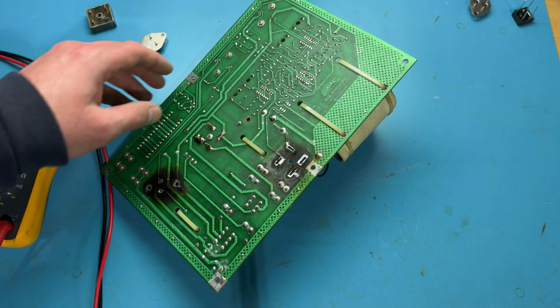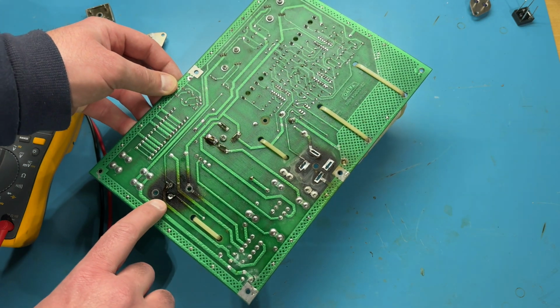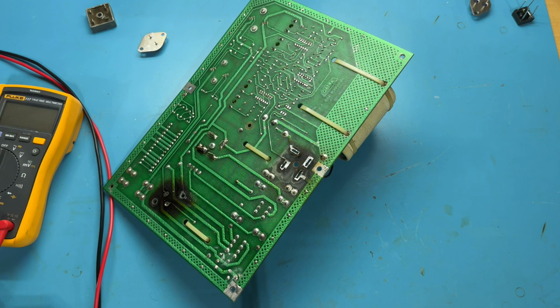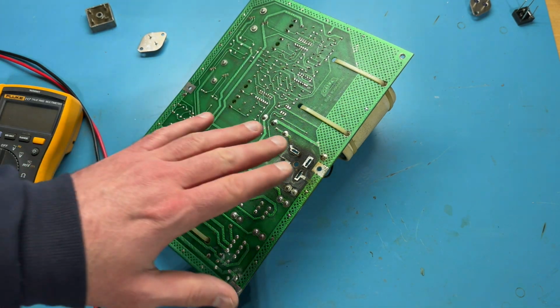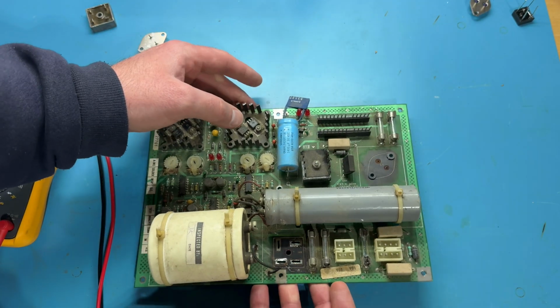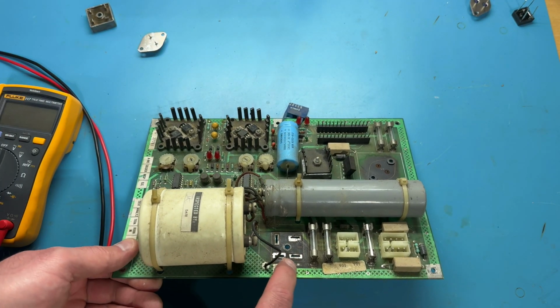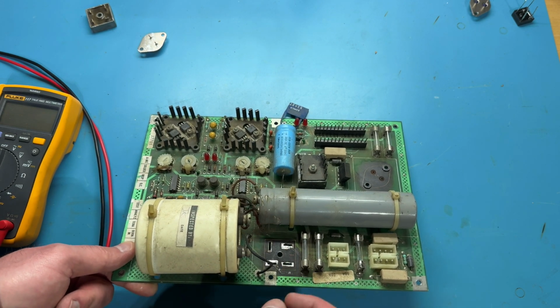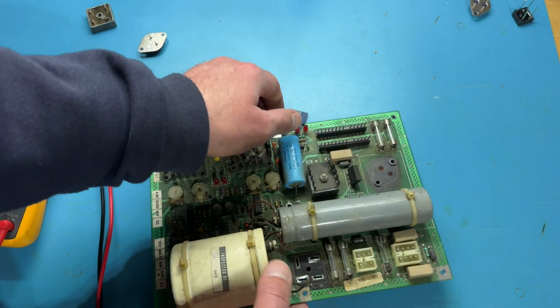There's a little bit of lifting on one of these solder pads for Q5, but not to the point where I'm worried. They're intact. They'll lay down. I'll be able to get that soldered fine. And especially the bridge rectifier is a two-sided solder pad, so solder has to flow through to the top. So I'll clean out these vias and make sure everything's fine before replacing them.